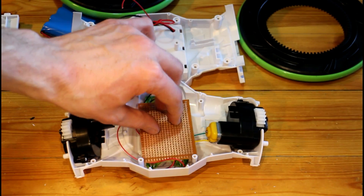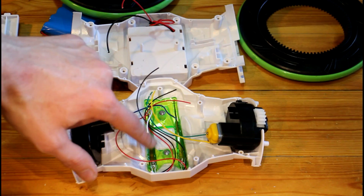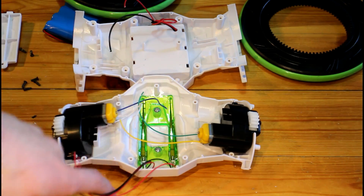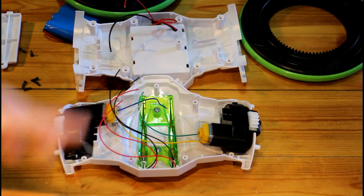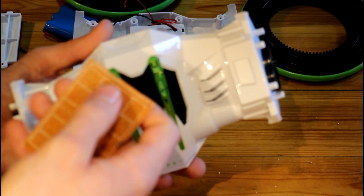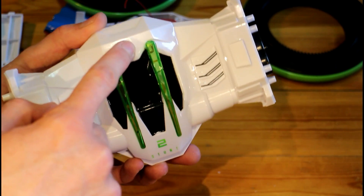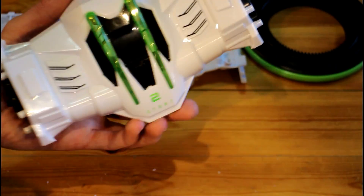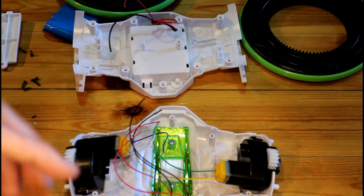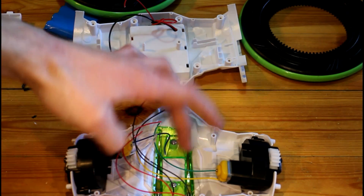I think I'll put a little board in there somewhere — probably cut it so I can screw it into the existing screw hole. That'll also cover the LEDs a bit and help brighten them, so I'll include those under Arduino control as well. I'll drill a hole in the top and mount a 4-by-2 header on the PCB so it sticks up through, and I can plug in a DuPont connector — a long-range or low-power module as I want. Then I can arrange the Arduino and motor driver around that.